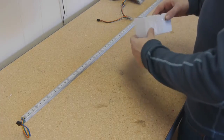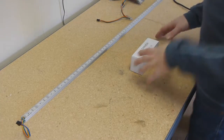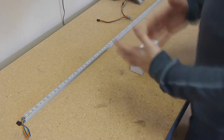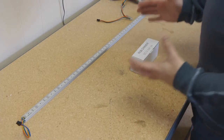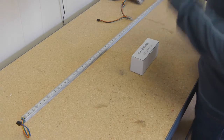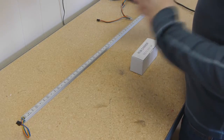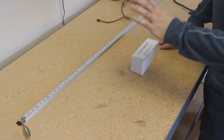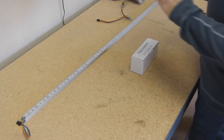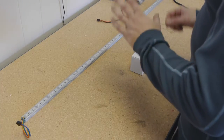This is a product that a lot of customers had been asking for, so we thought it was about time we feature it. And what it is, is a 3-channel, 3-knob RGB dimmer or controller. It does not require any DMX data, it does not require any sort of connection to a computer. It is a manual dimmer that the user adjusts the color through 3 different knobs of the RGB strings that are attached. Now this is for our dumb or unintelligent RGB nodes. It is not used for any sort of intelligent pixels. It is only used for dumb nodes.